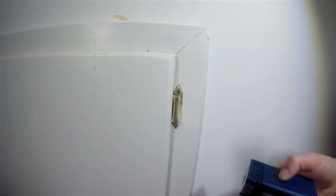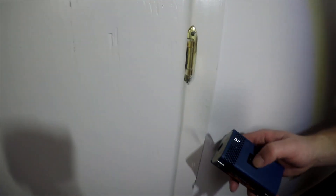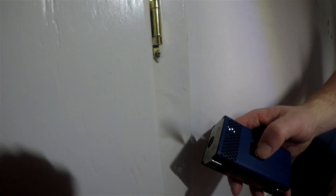So we can tell these windows never got sealed when they were installed. Here's an attic access door built into a new wall, and this leads into the attic space adjacent to this room. With the blower door still running to pressurize, you can see the smoke escaping the room through the crack at the door. Some weather stripping on this door would help prevent this.